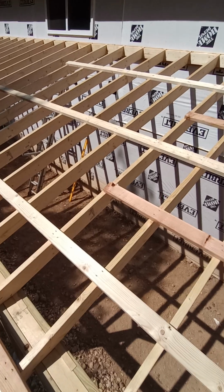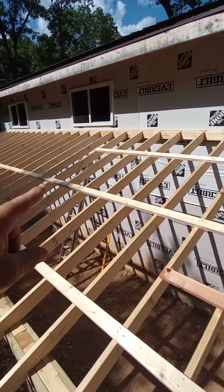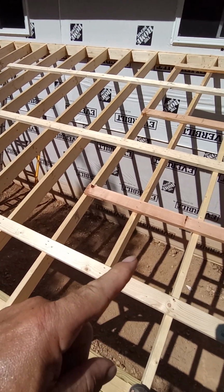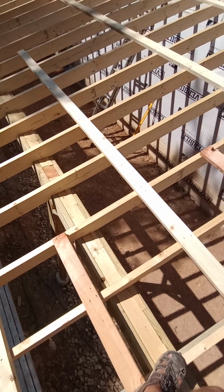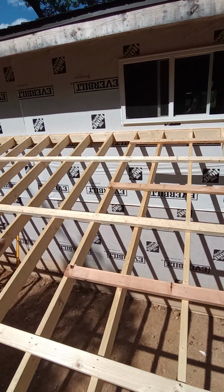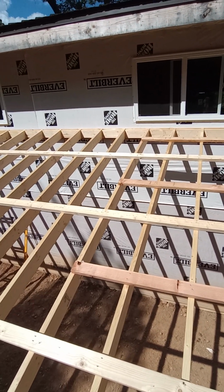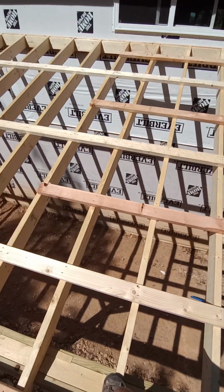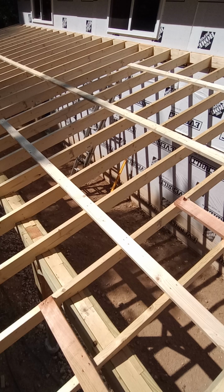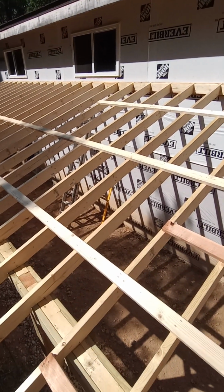And when I did my layout and I did my 16s, I only marked this center board all the way out. I didn't bother marking these ones because I nailed the top and the bottom on 16. And it really was just the middle boards that were flexed that needed to be pulled to our 16 mark. So the rest of these, I didn't bother drawing 16 or pulling a layout on each of these boards. Just the middle one. That's sufficient.